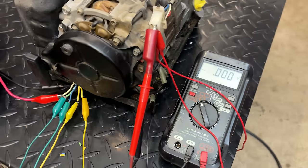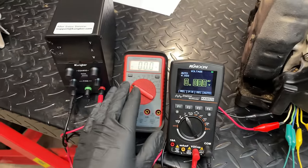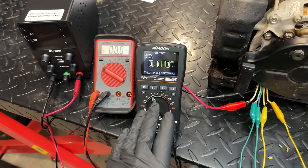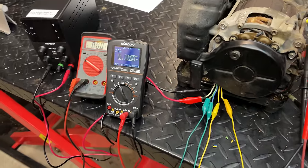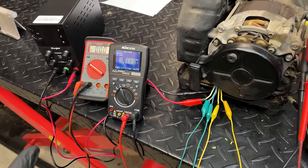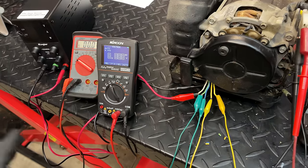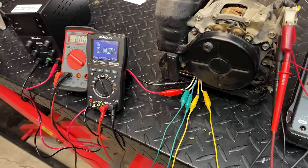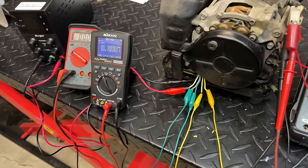That was some good information. So at 120 volts, no load, the sense winding was outputting 18 volts and the excitation winding 14 volts. So those data points you need to know, as well as the ones we gathered before, especially if you're going to try to use a kind of non-standard AVR. In this case, I'm still leaning towards the OEM AVR, but if for some reason I can't get it, then that data is needed.